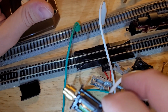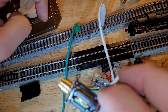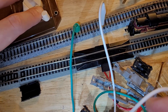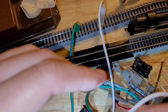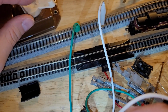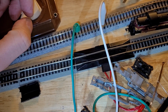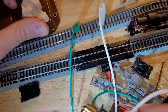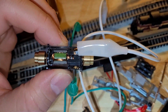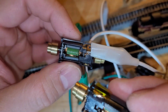So it looks like the motor I was going to put in with my cunning plan is actually in worse shape than the motor it had in there. And I think that evidences again by that chassis I showed you with the damage on it. So it looks like I got 2 busted motors. Oh, wait a minute. I see what's going on here. Oh, I just caught something. This winding is not supposed to be there, I don't think. Let's look at that other motor I just took out. Right over here. And I think I found my problem.